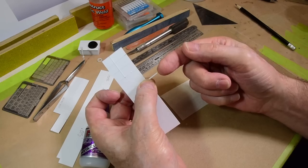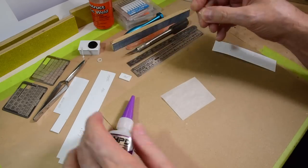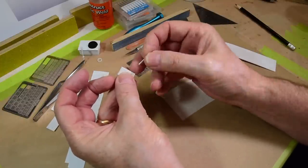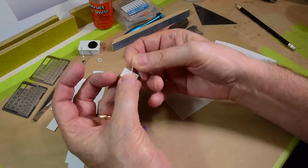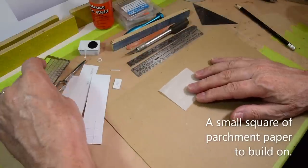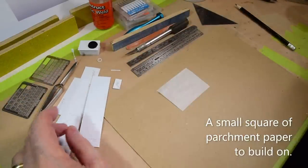all you have to do is flick it once and shear, it's going to snap right off, right? But if you do that with plastic weld, as you flick it, it's just going to bend, right? It's not going to snap off. I mean, you can break it off eventually, but it's going to bend and flex because it's welded, okay? And then, yeah, tweezers and, you know, whatever your tools are. Okay, so